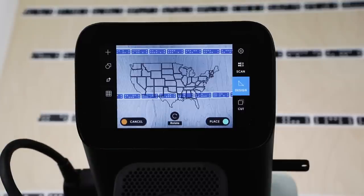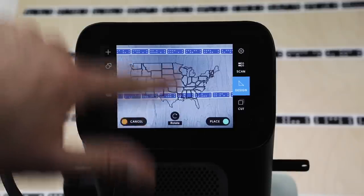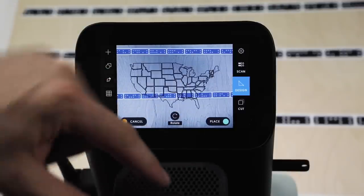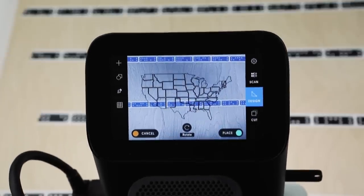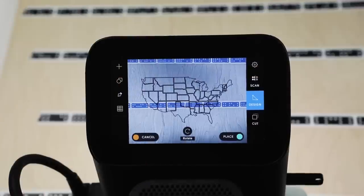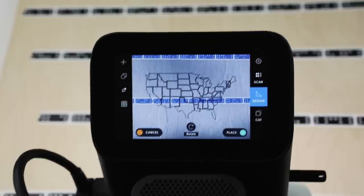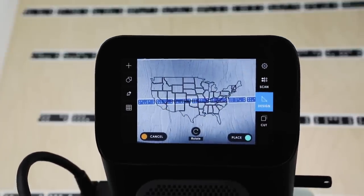So there we go. Now, keep in mind, the bottom of this shape and the center of the shape aligns with the very center of our cutter here. So just if you need a reference for globally where you're placing things, it'll be aligned north of that and out to the side. So we zoom out to the extents of the file we're placing, and then Origin is behaving like a big mouse where we choose where we want to place it.